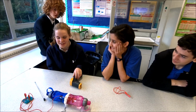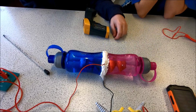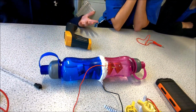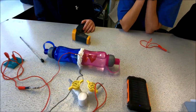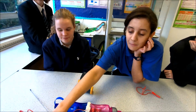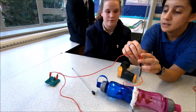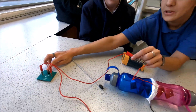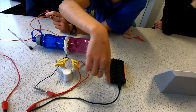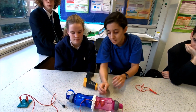Okay, right. So basically, this is our finished water bottle at the moment. Last week we sealed it off with some thermal glue so that there weren't any leaks, well, as little as we could possibly make it. And we've connected it up into a circuit with one end of the Peltier device connected onto a switch, which you press down to turn on, and you expect the current to go through this, come back, and go around and heat one side and make another side cooler.